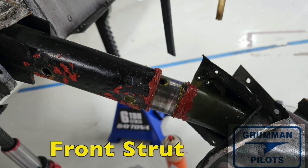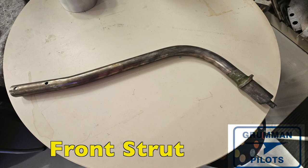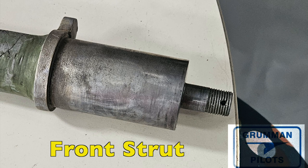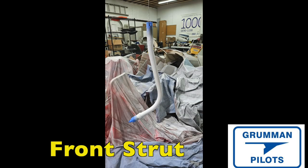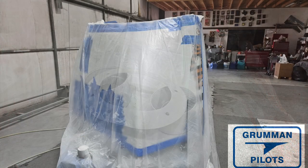It took a while to get out. Not having been pulled in 11 years, we didn't find any corrosion — the spindle was in good shape, a lucky day for the owner. We've had aircraft where the spindle hadn't been pulled in seven years and had to be cut out of the airplane. When you pull the spindles periodically, clean them down, prime them, check everything, then paint with a good hard polyurethane or Jet Glo. You want paint on there because chips from the propeller and runway debris on the front strut can allow the metal — which is an iron-type metal — to start rusting. Here it is hanging in T6 Bravo getting painted and going back on the airplane.